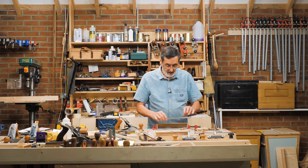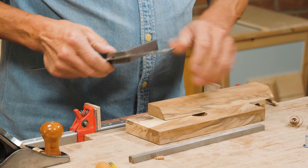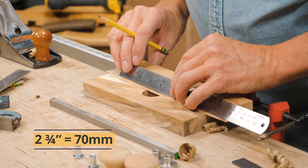I'm going back to my piece of wood to compare the grain. I'll start from one end — I'll be cutting this down to five and a half inches eventually, but I've left it longer so I can work it in the vise. The middle of five and a half is two and three quarters — so I come in two and three quarters. That's my center line.